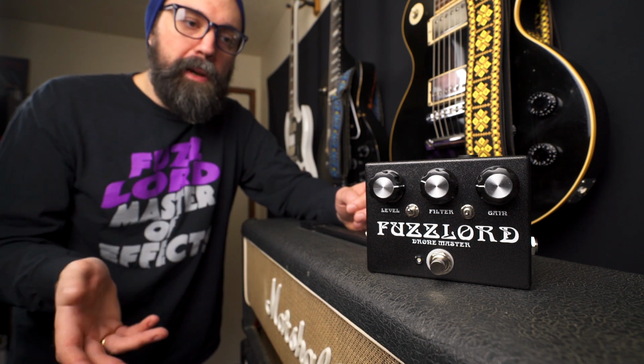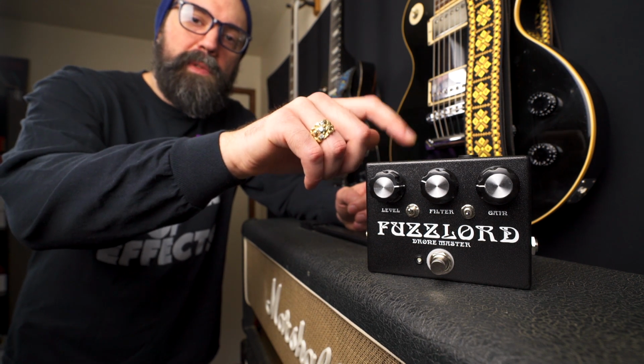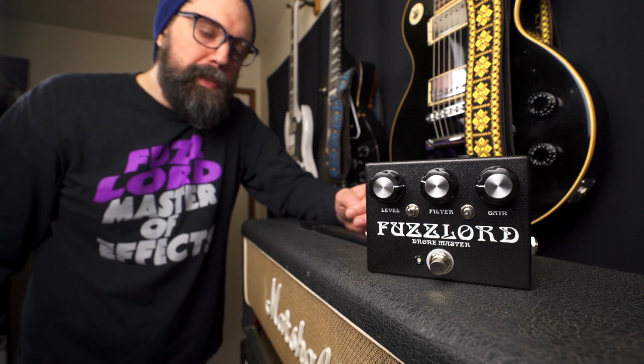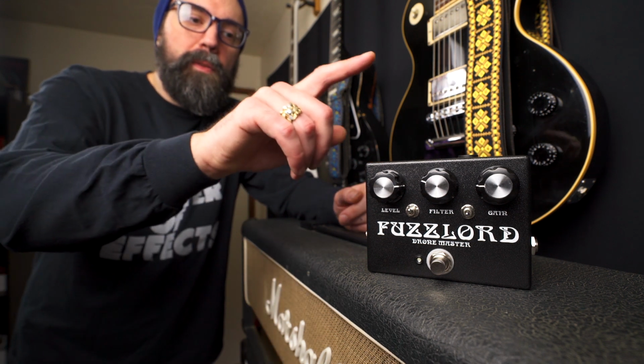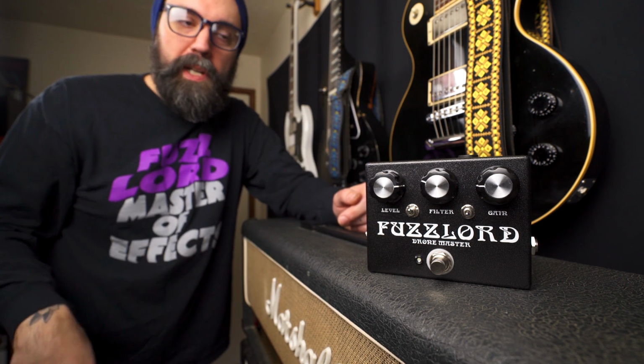If you want to make that decision for yourself and hear the difference between a 308 chip and an OP07 in a Rat style circuit, head on over and check in with Steve Reese from the Does It Doom YouTube channel. I'll leave a link in the description. He does a great comparison between two Rat pedals, one with a 308, one with the OP07. We decided that the OP07 sounded a bit better, so went with that chip for the 2020 line of Fuzzlord Drone Masters.